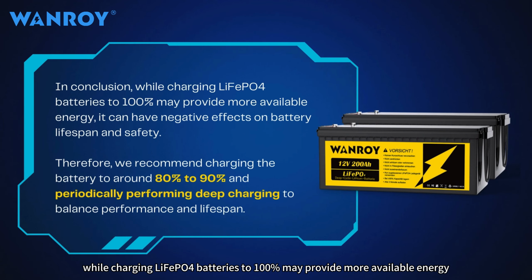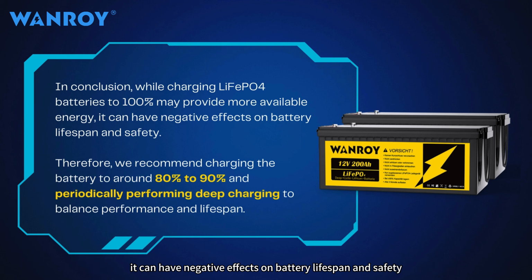In conclusion, while charging LiFePO4 batteries to 100% may provide more available energy, it can have negative effects on battery lifespan and safety. Therefore, we recommend charging the battery to around 80% to 90% and periodically performing deep charging to balance performance and lifespan.